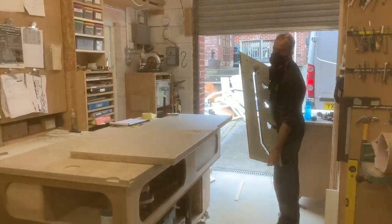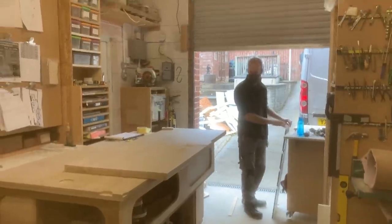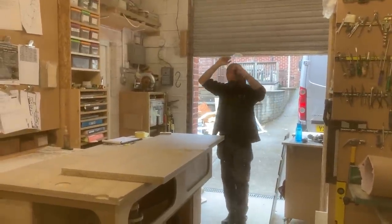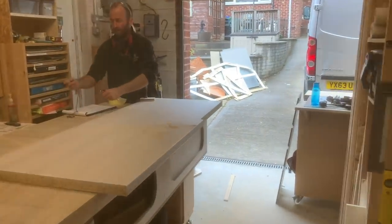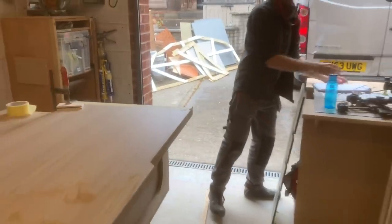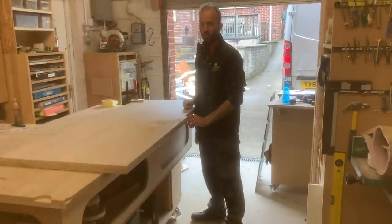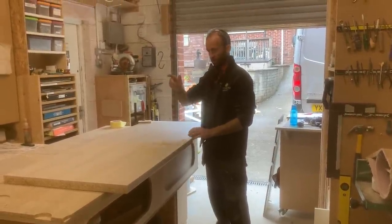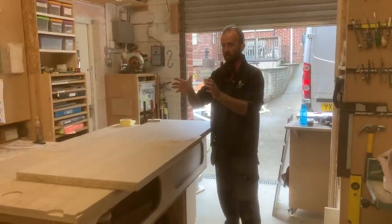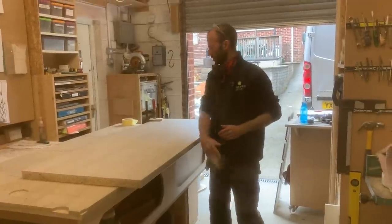How would you fix that, even if it is wobbly, because you're referencing off that front face? You mean if it had been wobbly and gone in too deep? Yeah, so like let's say the edge wasn't true and straight. Because then if you went in deeper, you would definitely reveal some chipboard there. You could maybe try cutting that one in more, but then you're out on your own with no stops. You can't reference off anything then.